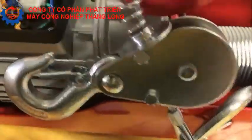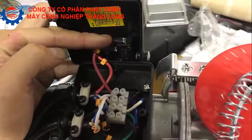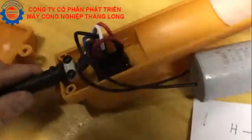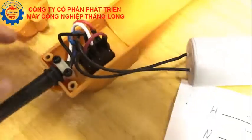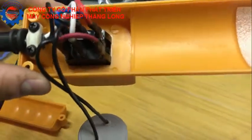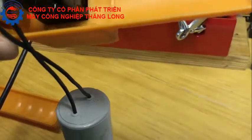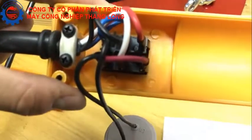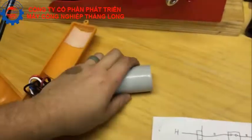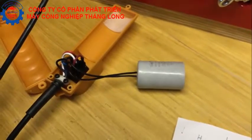Take pictures of where all the wires go. Three of them go into the terminal block and one goes to your safety switch that cuts out when the hoist is fully retracted. On this one there are three female connections — one, two, three — and you have to double up on one, meaning two wires in one terminal.